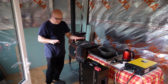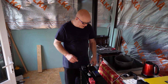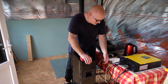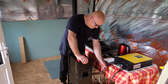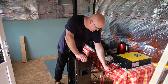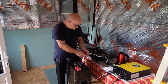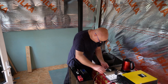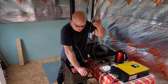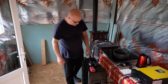If you buy this kit, this is what you'd have to do once you've got it out of the box. These cables are pretty easy to connect — it's just like wiring a plug. You have to connect the two cables for the solar panels, two cables for the battery, and then I just got one of these extension leads, cut it in half, and wired both ends into the inverter. This one goes into your grid power or your generator, so this is not connected, and you're going to see the battery's got some charge in it and we're going to connect the panels outside.